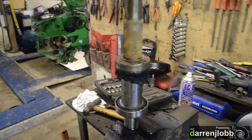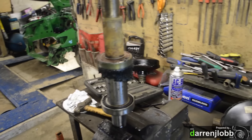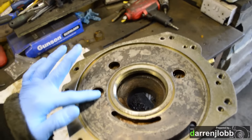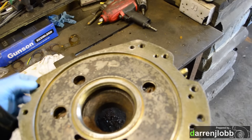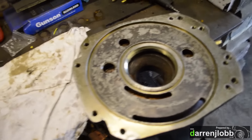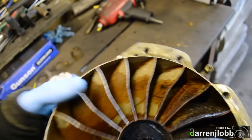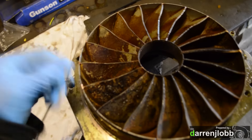The next step — I've got the shaft in the vise and I'm going to remove the two bearings and replace them. These look like original ones, they're grindy and generally noisy, and as you can see the grease is completely dried up — obviously there's been water getting in. We've got the stator cleaned up now after quite a lot of time cleaning all the crud out of the waterways — they were all absolutely solid with crud, which is quite normal. We've got down to the vane entrances. The fill port on one of the vanes is now completely open and water is flowing, however the air bleed is absolutely solid and there's no way we're going to be able to clear that.